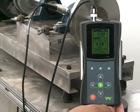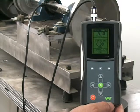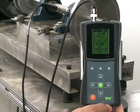As the black stability bar begins to settle, we can see the overall vibration level is now approximately 3.15 millimeters per second peak. The bearing condition is 0.39 Gs.